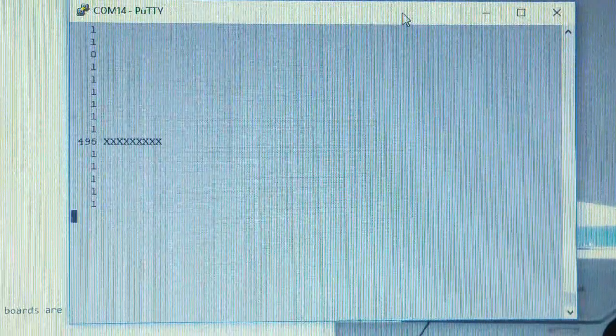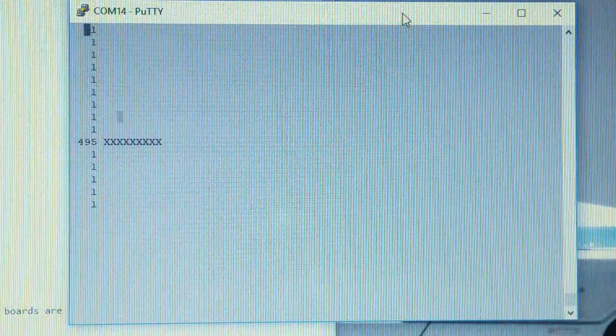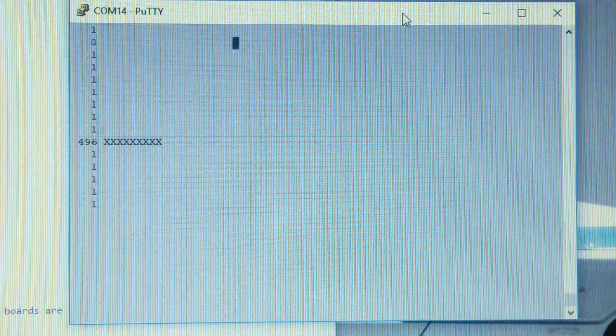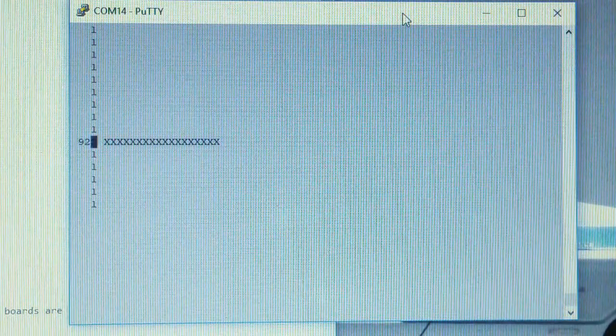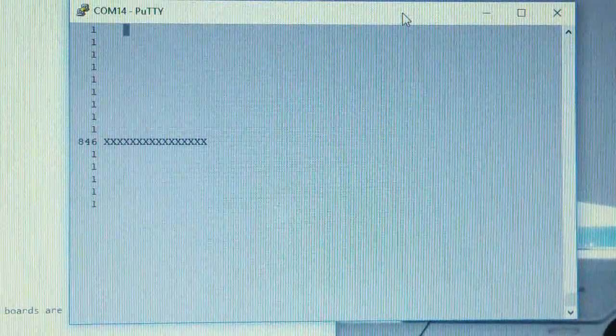So usually what I would consider good enough for a knob is if you can get to 100 or say 200 different positions, typically, without much oscillation. So I think if we divide these maximum values of 1024 down by 5, that noise would go right away. It's also possible to put filters in there, but we won't get too far into that.